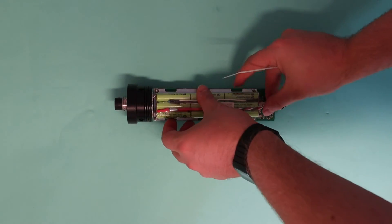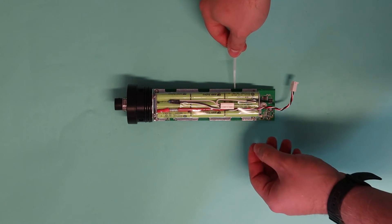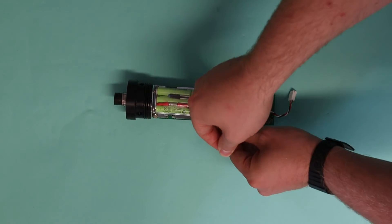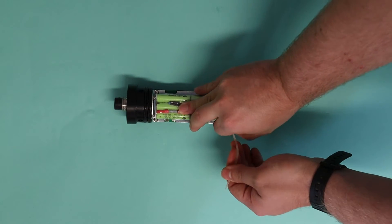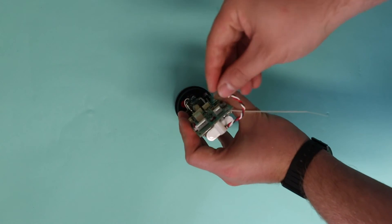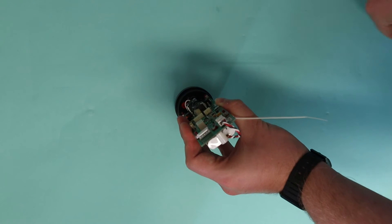To replace the battery, simply place the new battery flush against the transducer connector end cap. With the battery in place, put a tie wrap underneath the metal support plate and around, tying it into the little notches on the side. Cut these when in place. With the battery secure, simply plug the molex connector back into the electronics board. And that's the battery changeout complete.